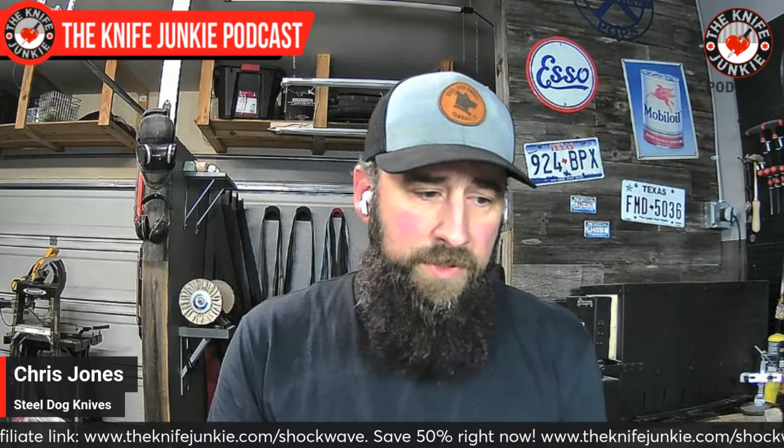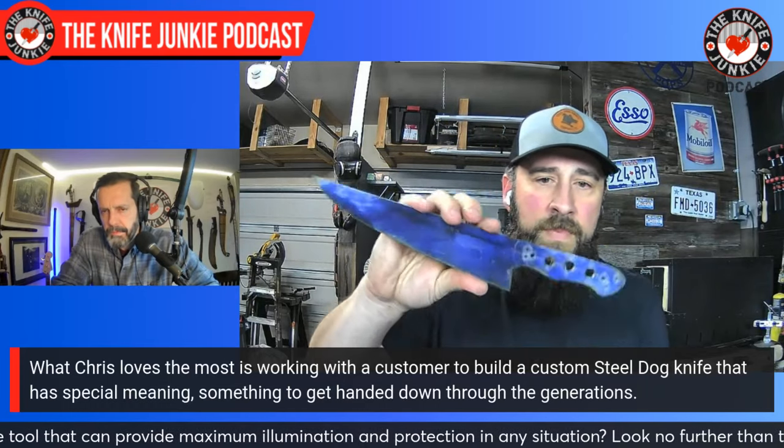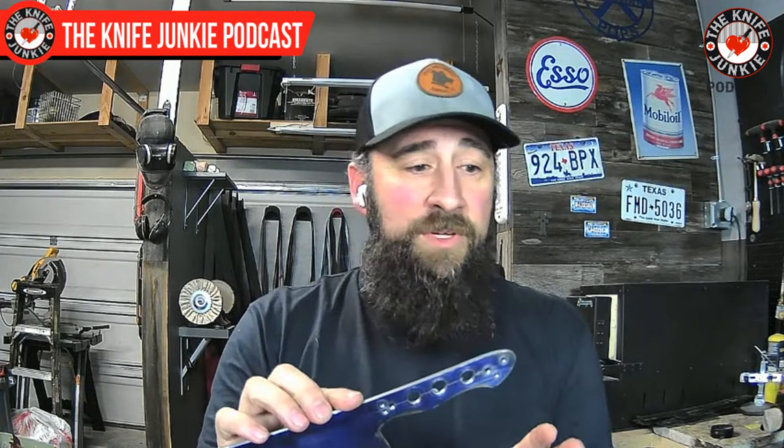My process is I do a lot of stock removal because I work with a lot of stainless. I take a stainless blank and try to work with as thin a material as I can get by with while still being functional. For a chef knife, I'm typically doing 3/32nds inch stock. AEBL or Nitro-V is typically my go-to. I'll draw out a design, I've got templates, then I'll make it out of wood first — not put the bevels on — just to get the look, feel, grip, and hold it and say, does this work? That becomes a template. Then I'll put layout fluid on and cut it out on the port-a-band. I drill my holes and get everything set. Then I actually wrap it in foil, put it in the kiln, and heat treat it. I heat treat at full thickness on all my chef knives — that helps minimize some warps — and then I come back, scribe some lines, and grind.